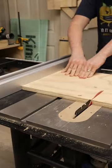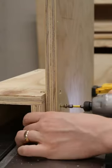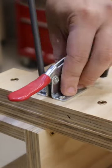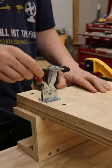I cut a larger piece to support the board and attach it to the runner with more countersunk screws. Then I square up another strip and tack it on to support the board as it runs through the saw. And I install this little clamp thing to help hold the piece in place.